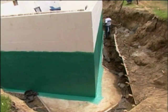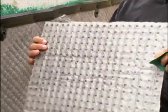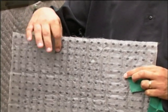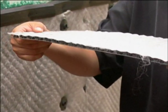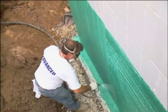On top of that, what we put was a drainage material — this is it right here. It's called the GeoWrap drainage membrane. It has a filter fabric on top of it, which allows the water to go through the filter fabric but doesn't allow the earth to go through. And if you look here, you can see in the cores the gap, and that's where the water travels down to the footing, getting the water down right away and eliminating any chance of leakage into your foundation.